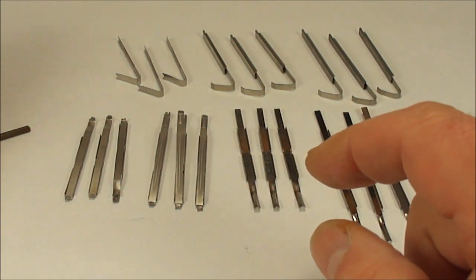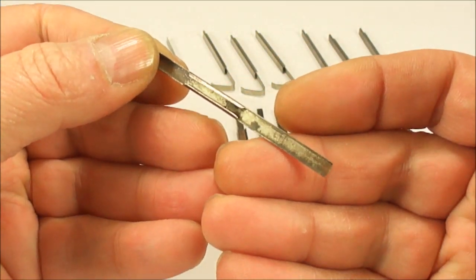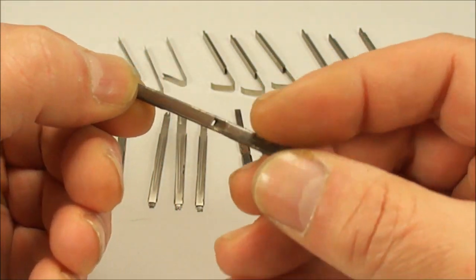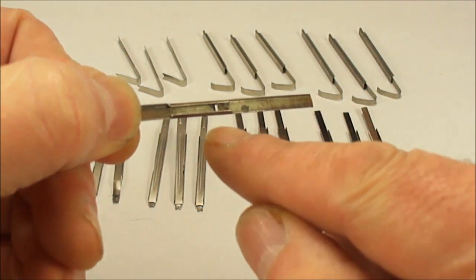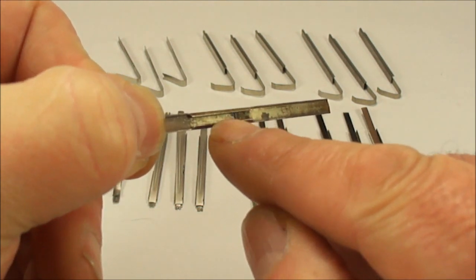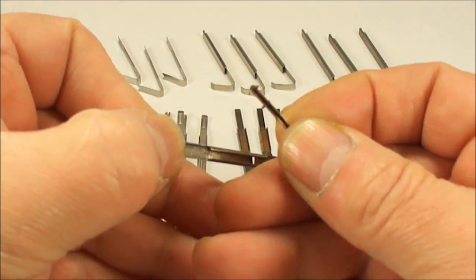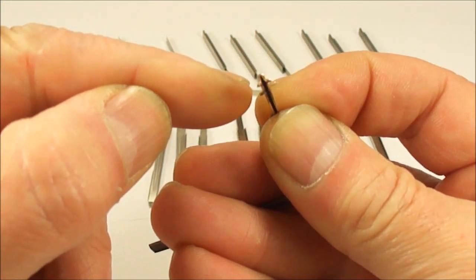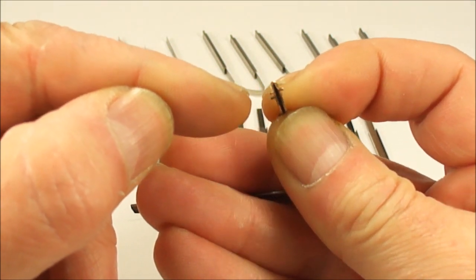First of all, to the left here, we've got what we term a floating pressure bar, or some people call it an angle bar. These are commonly used on the likes of Conway Stewart and Waterman pens, and you'll see they've got two rails, if you like, to the side in the middle there. The reason is that for a lot of Waterman and Conway Stewart pens, the lever has these two winged lugs at the end.